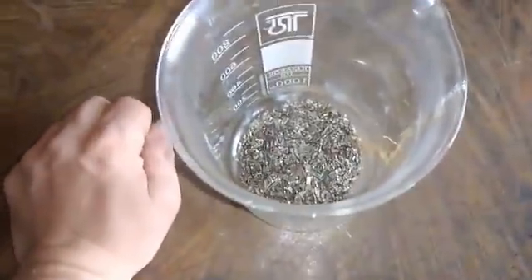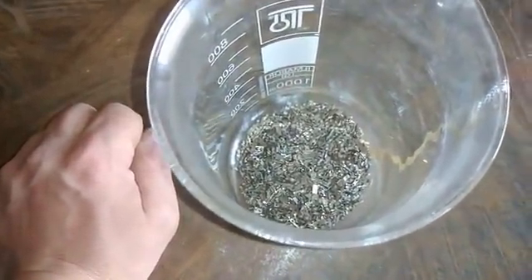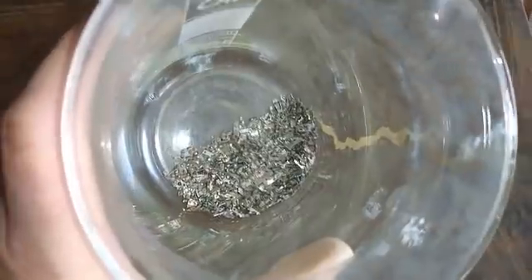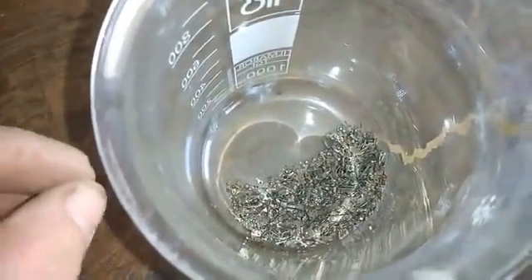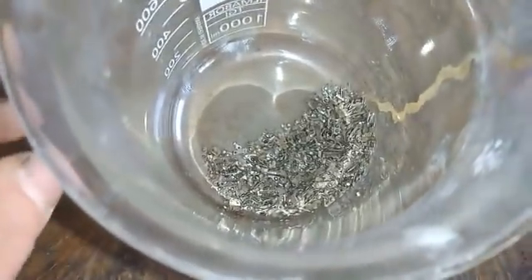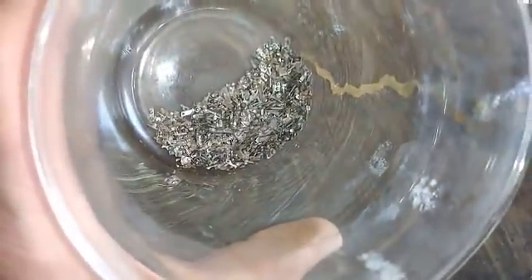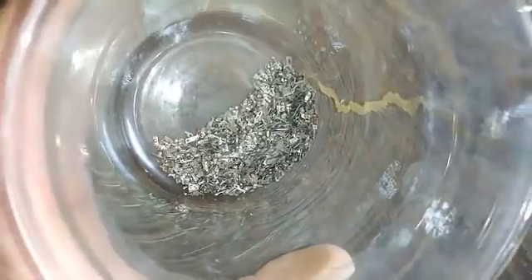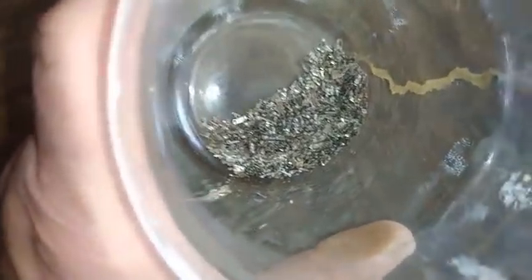So right now what I'm going to do first — just in case I have some palladium there — I will soak that in the Poorman's Aqua Regia. I want to remove all the base metal and leave only the silver beads. Poorman's Aqua Regia doesn't dissolve palladium as easily as normal Aqua Regia. I already did that a couple of times and it worked perfectly.